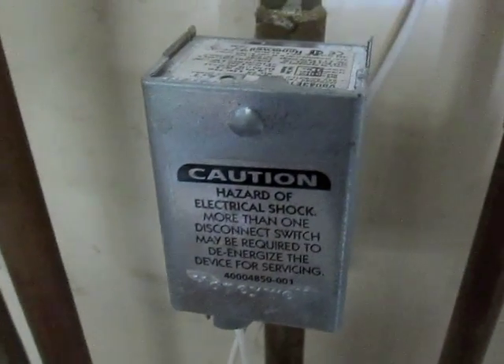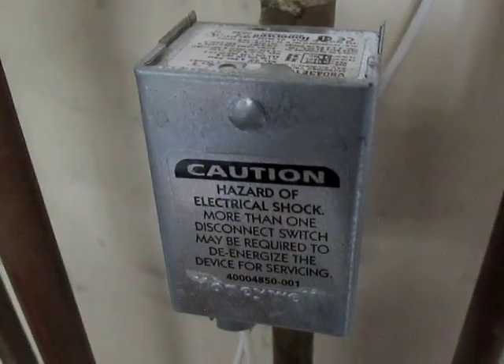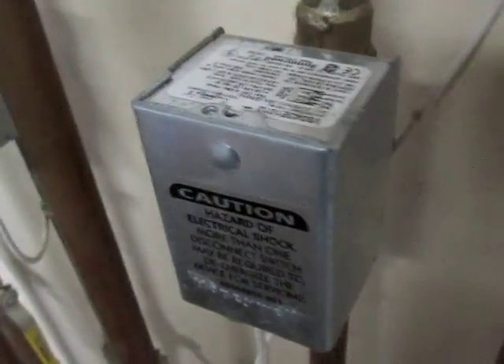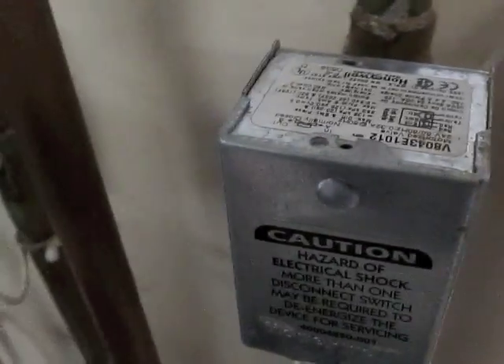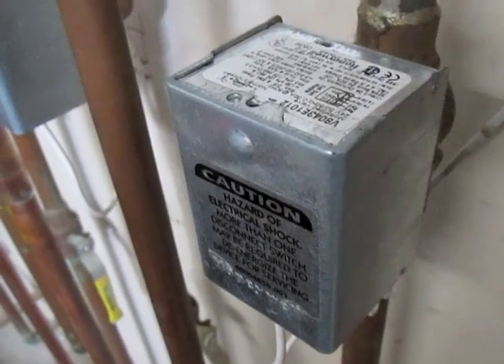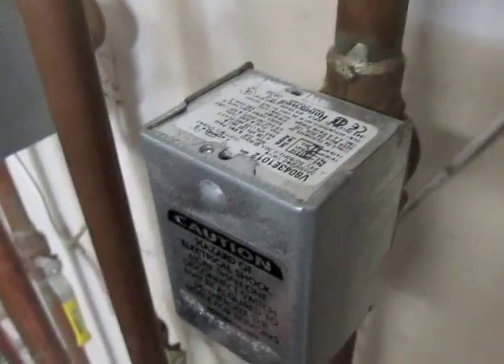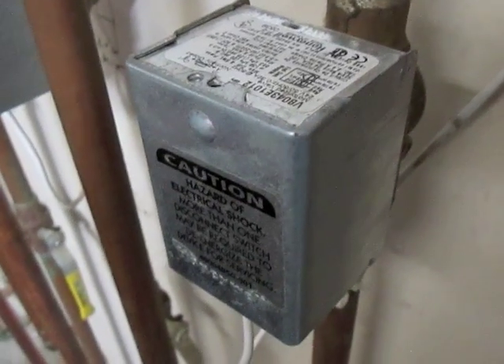And that took all of less than five minutes. After replacing the cap on, I will go inside, turn the power on, and then make sure that I turn the thermostat up about 10 degrees higher than what the temperature is. This zone valve motor should kick in, and we'll see.